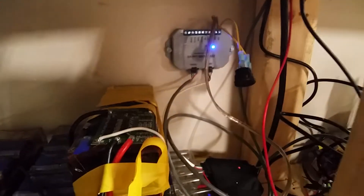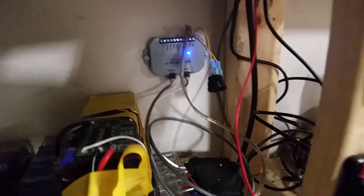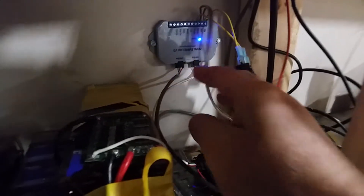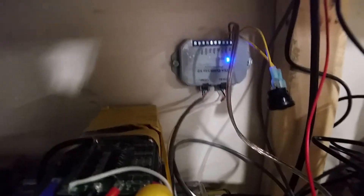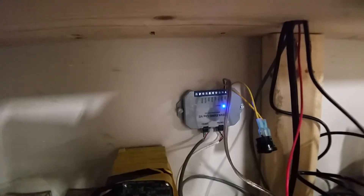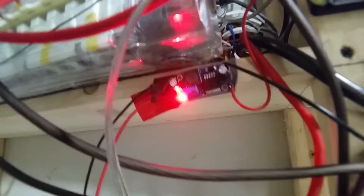But it was really easy. It was a little pricey, but I guess it all depends on what you're looking at. Since I spent a good chunk of change on those Tesla batteries, I did not want to destroy them. That's why I paid the extra money for the BMS. Let's see if I can get in there a little bit closer — it does have some nice features. It's got charge, auxiliary control to tell when you're driving, an LED control, a charge-in function, and a buzzer. And what's cool is it runs off 12 volts.